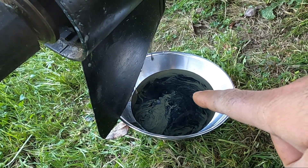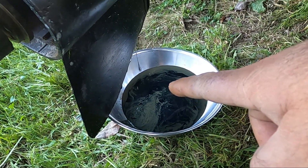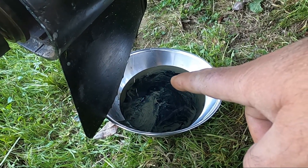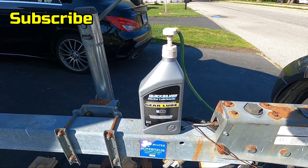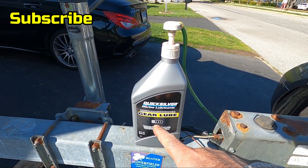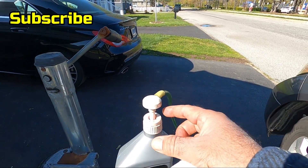If you see, my oil is a little bit murky, meaning it's taking in a little bit of water. I believe one of my screws' washers is not good, so the water is going in. The oil I will be using is Quicksilver Marine Lubricant, the gear lube SAE90.